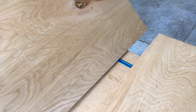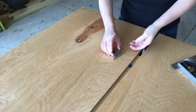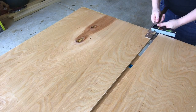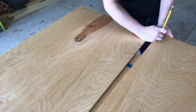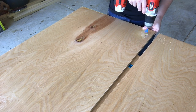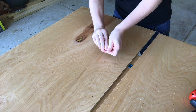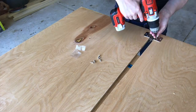To install the hinges, I laid out my doors the way I wanted them to look when hung and then flipped them over so the hinge sides were facing toward the interior. I decided to use a traditional hinge because they're cheap and easy to install. I want you to see the profile of the way these look so that if you choose to use them, you don't inadvertently install them upside down. I used a square to make sure my hinges were mounted equal distances from the top and bottom edges on all the cabinet doors, and I mounted these on the surface. I only did this because I'm using half-inch panels. If you want to recess these, you need to use a three-quarter-inch panel door, and I highly recommend three-quarter-inch doors if you're concerned about your cabinets getting any rough treatment.